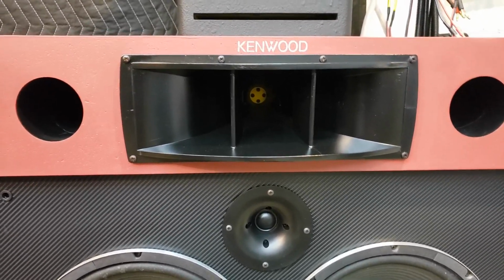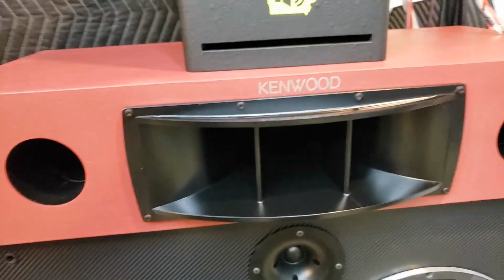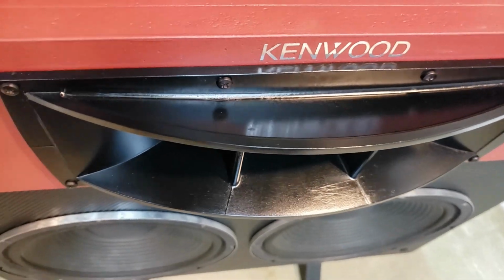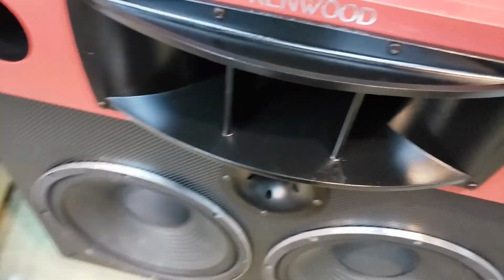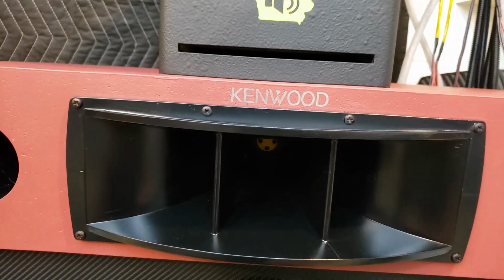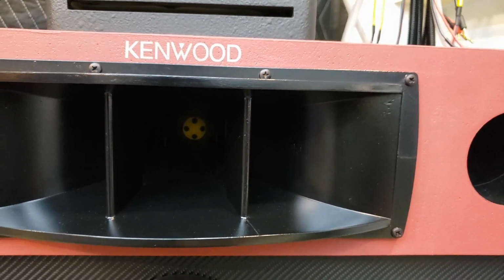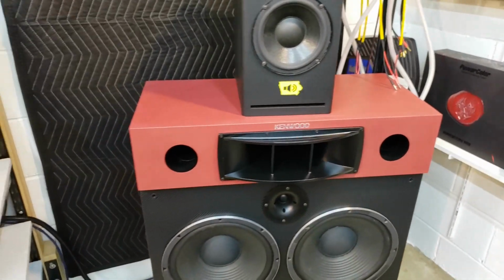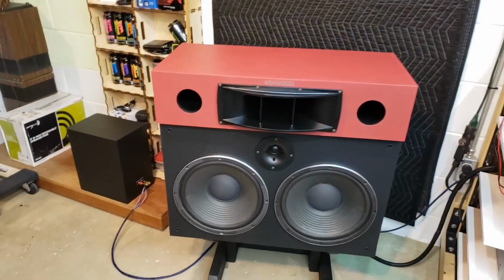And then to add my little touch, the waveguide on the dome in there was black. When I took these completely apart, pulled the whole horn off, everything, there is some aluminum pitting, and I sanded them down a little bit. I didn't want to get too aggressive. I just tried to smooth them up and coated the horns with about 3-4 coats of good paint, so they're nice and black again. I took everything down to the voice coil, pulled the diaphragm out of the driver for the mid horn, checked it, cleaned it. The waveguide is a separate piece in there, and I painted it yellow, which is my Iowa Audio thing. If you're not looking too close, it's not very noticeable. Only when you shine a light down in there can you see the yellow. Excuse me, it's really dry down here.